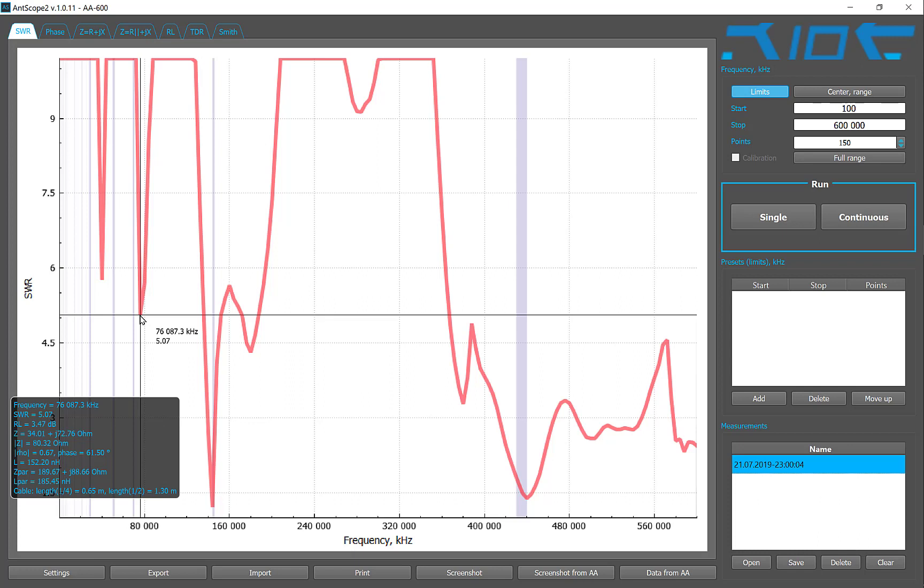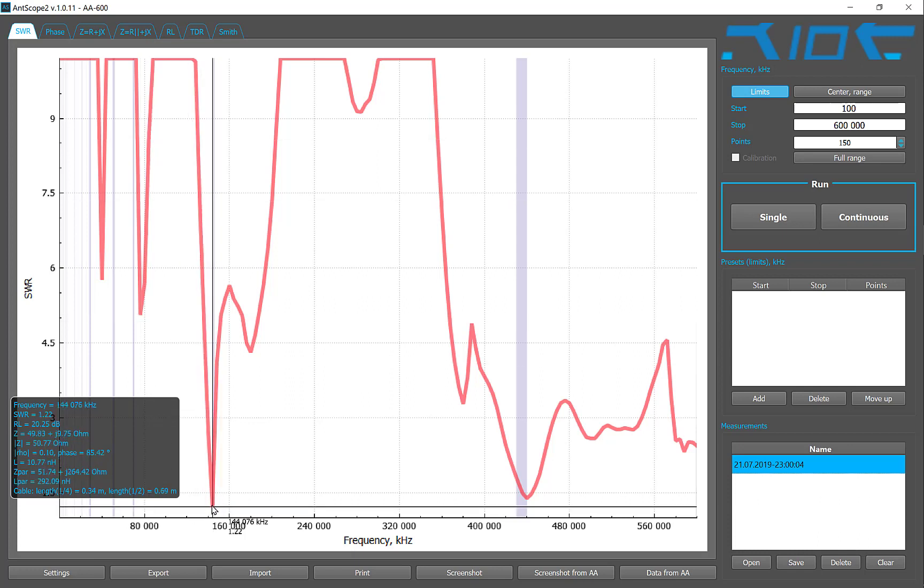My understanding is that those numbers are pretty poor. But down here at 144 megahertz, that's definitely going to help out — that's the two-meter band — and we are at an SWR of 1.22. On the package it says 144 MHz is 2.15 dBi, so that's interesting.